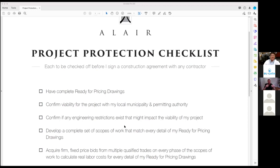So there's two questions there. If you're refinishing your basement in Arlington County, the overall Virginia code requirement for occupiable space is 7 feet. Arlington County has adjusted that and gives you a couple inches because a lot of your basements are less than 7 foot clear. So if you're remodeling your basement for your own use, you can be an inch or two below that 7 foot and be okay.